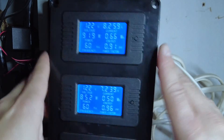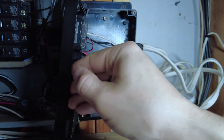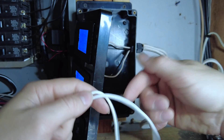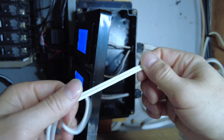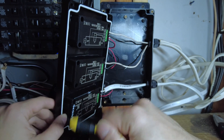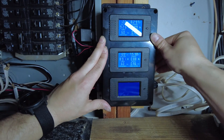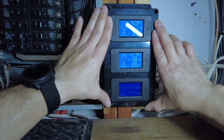Let's close up the box — go slowly so you don't pinch any wires or break connections. The box also comes with a white rubber weather seal that fits into the groove around the back edge to keep moisture and rain out. It goes in super easy. I'll add it anyway in case small bugs or spiders try to get in. The generator meter is currently off because that circuit breaker is off — it'll come on when I switch to generator power.